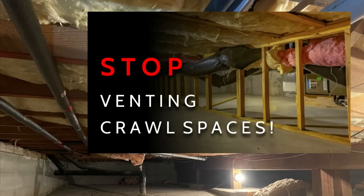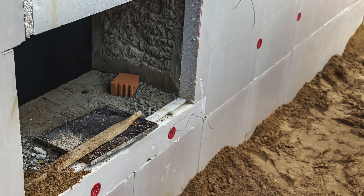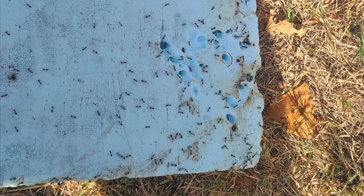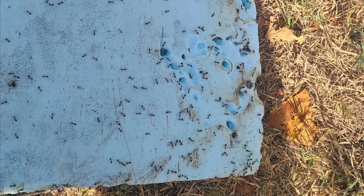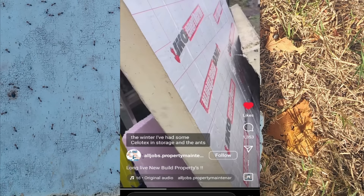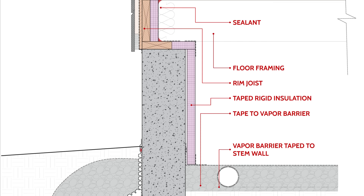The next comment is about my video on insulating crawl spaces: 'Insulation on the interior side of the stem wall is incorrect — insulation should always go on the exterior. Where do you wear your coat?' I generally agree with this sentiment. However, when locating insulation below grade, it's at a much higher risk of deterioration from bugs and water. If insulation gets saturated, you get a loss of R-value, and bugs love to burrow into it — especially rigid foams. There's a video of ants totally swarming polyiso that someone had on a job site, not even outside, on a slab — and they started burrowing into it.